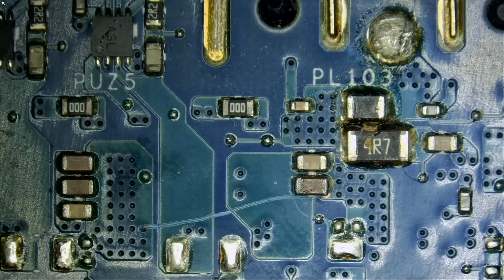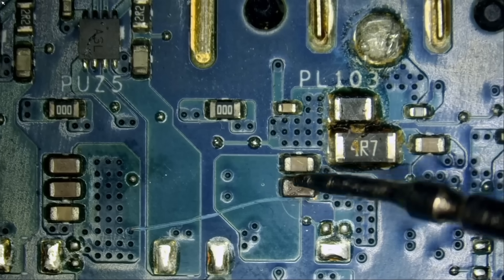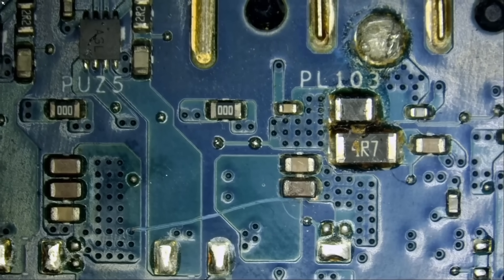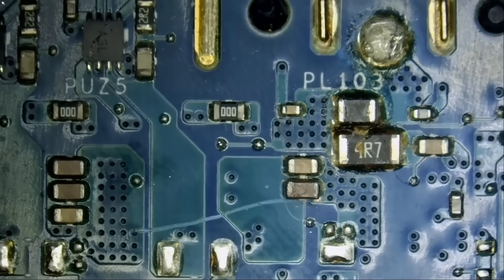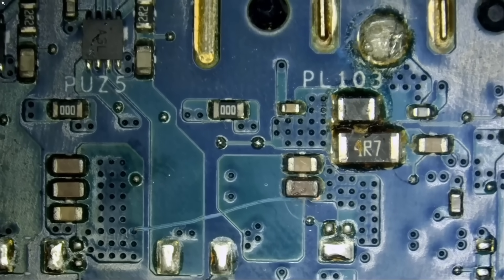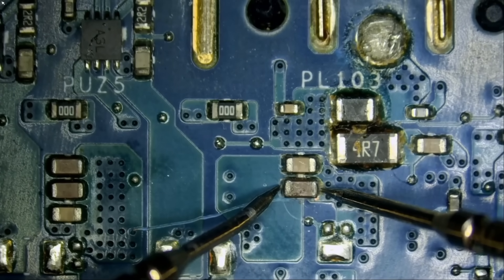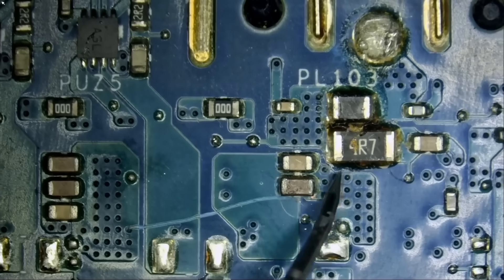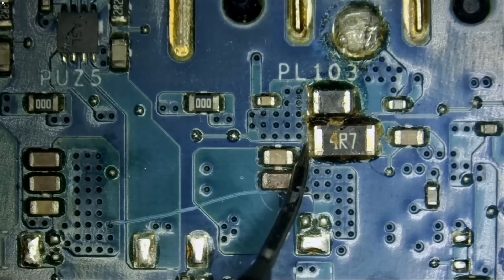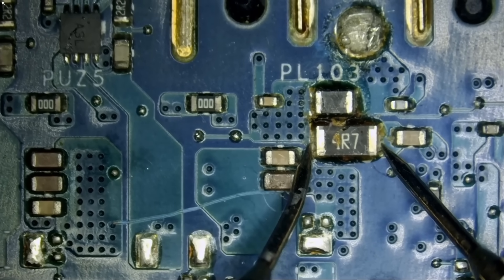Let me record the video and see if we can figure it out together. One thing that stands out is a discoloration in this capacitor — this one looks different. I do not know if that capacitor is in fact shorted. If we measure in diode mode, we have a dead short, a zero ohm short. If we measure in ohms mode, we should be reading about 4.7 ohms on this resistor, and my meter is showing 4.8 ohms — perfect. So we know the resistor is good.